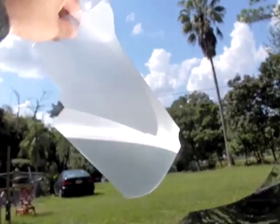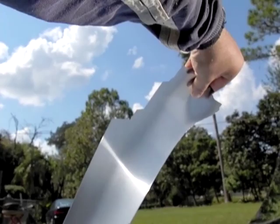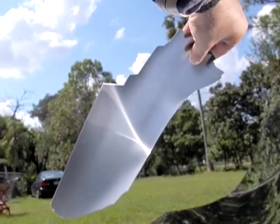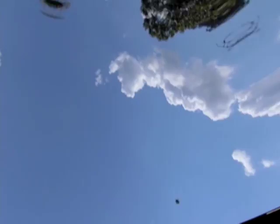The sun's probably at a tighter angle but you're going to be able to adjust this for the time of year. You can see where those beams converge — you'd want your pipe to be a little bit closer, with as much of the light on your pipe as possible. This is a long eight-foot linear beam, so if you run a 10-foot black piece of pipe across here, it'll get it really really hot. The goal is to jump water temperature up to about 250 degrees by concentrating all that sunlight. All the directions and measurements will be on the website. I'm your host Dan Rojas — thank you for watching.